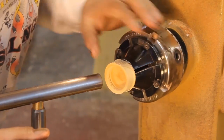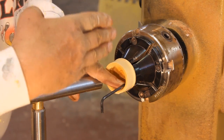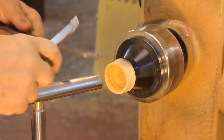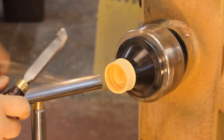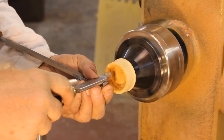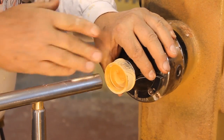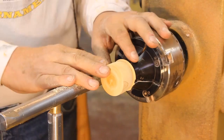I can tell right now that they're nice and crisp. You can tell whether your threads are pretty much parallel — I've just been using an Allen wrench in there, and I'm just a little bit tapered, so I'm going to do just a little bit more chasing to try to take care of that slight taper. I'm going to reduce my lathe speed since I have my threads pretty much established. The box lid is finished — inside has a little finish on there, threads are done. So I'm going to take this out and put my base in.